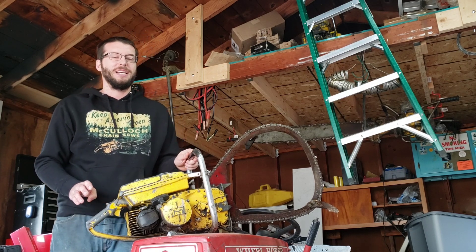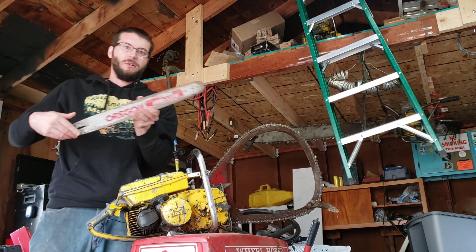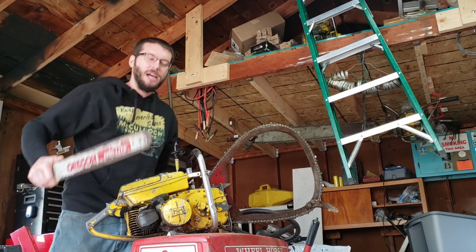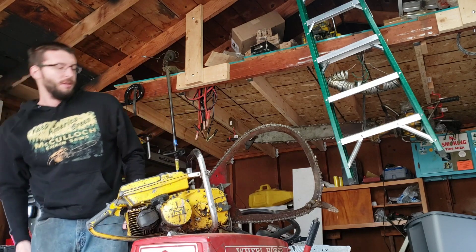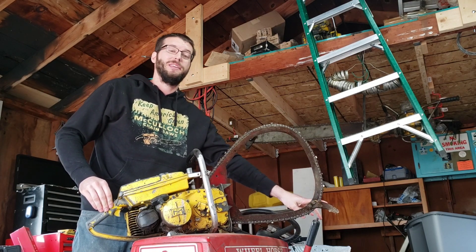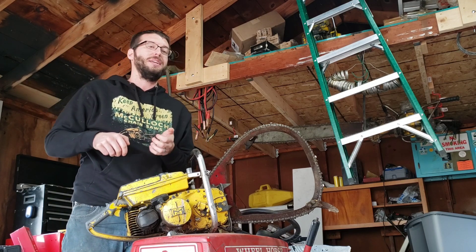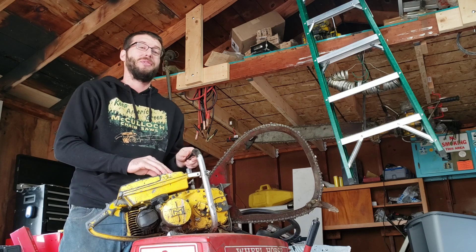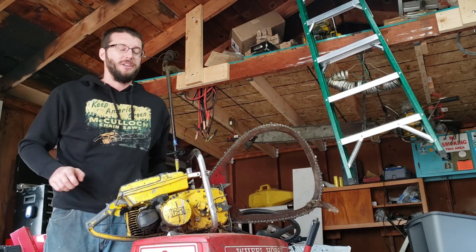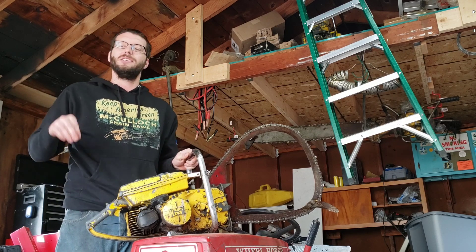Run safety chaps and all your PPE — that's a recommendation. Now, why would you want to use a bow bar over a traditional bar? Like I said, less getting on the ground. With a regular bar, this is the cutting surface, so you have to get down, cut, back up. With this, you are cutting with the front part. The saw is about 30 pounds, so you're letting the saw do the work and just pivoting with that foot to do the cuts. Depending on how tall you are — I'm 6'1" so I hunch a little — but it beats getting up and down.